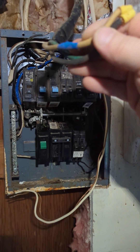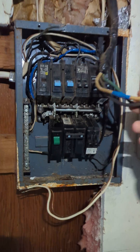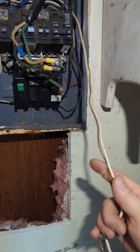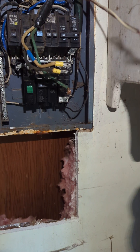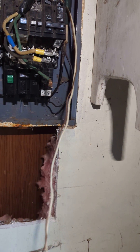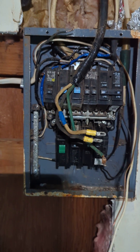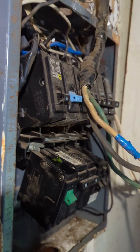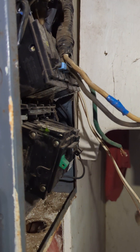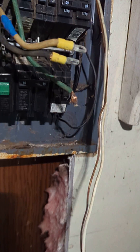It's a little bit of a mess — understandably, because it's a house fire and they had to get all their stuff out. I've got to disconnect all this stuff. You can't have extension cords running through the walls. There was no grounding out here — they just had a three-wire running out with no ground rods, which is a problem since it is a detached garage. Anyway, just asking: does anybody know what these panels are? If I can find the cover I'll post a picture. Again, very narrow.